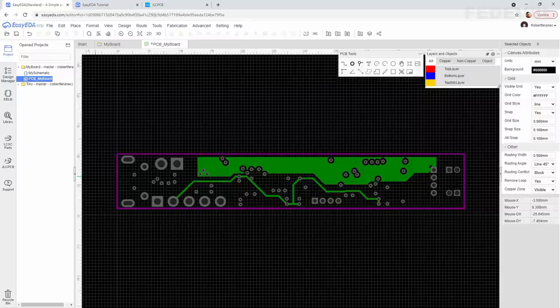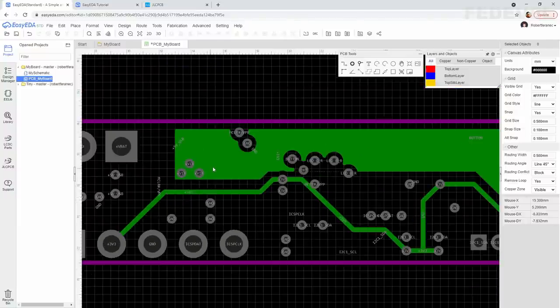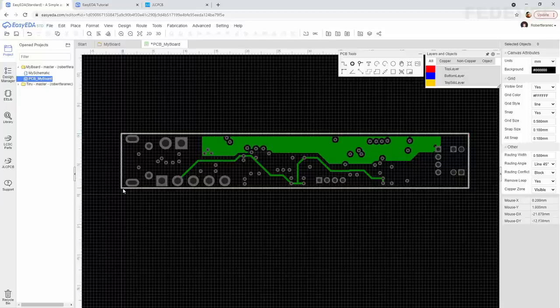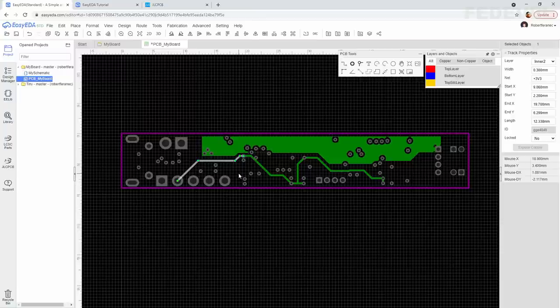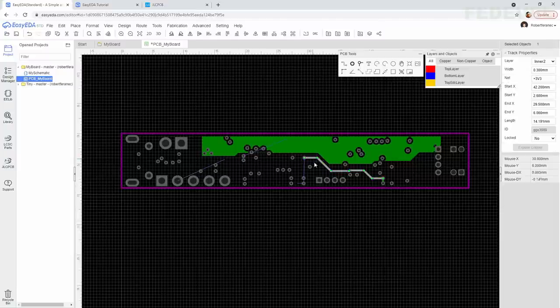To draw the plus 3v3 copper area is going to be super simple because this copper is going to have higher priority. This copper is going to be drawn first when this layer is rendered. It means we can simply just draw this plus 3v3 all around our board and it will automatically flow around this existing copper area, which is already here. You will see what I mean. So I'm going to select this, delete, select all these and delete them.